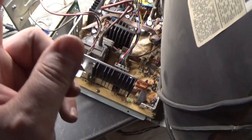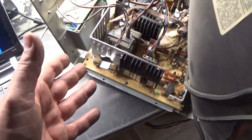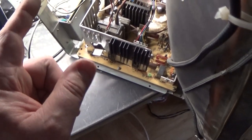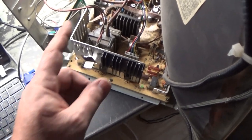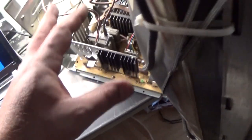Minus the flyback — I let this run previously during initial testing before the rebuild for about half an hour, and the brightness and focus did not drift at all. That's fantastic news because we are not going to need a new flyback. Flyback is good and reliable. Rebuild is complete.